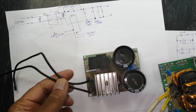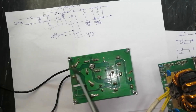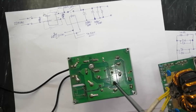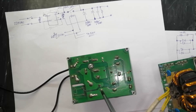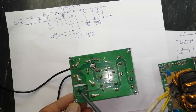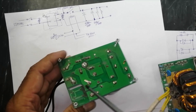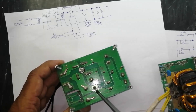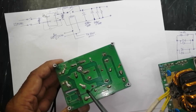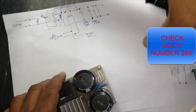The input rectifier receives AC input, a heat sink mounted bridge rectifier rectifies the voltage into DC voltage. These voltages are transferred to two parallel capacitors. The positive voltage passes through an NTC which charges the capacitors. When more current is needed, a drive command comes at the coil points and it contacts, passing voltage directly to the capacitor and bypassing the NTC. So when more current is needed, the 110 ohm NTC is bypassed and we take full current. This is the output terminal of that unit.